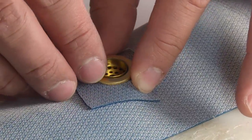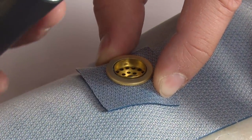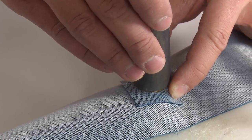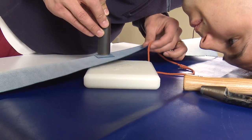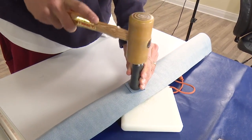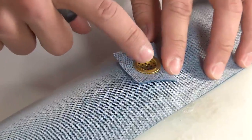It is crucial that the grommet sits on the anvil below and that the top die fits perfectly over the male portion of the vent grommet. After checking that everything is lined up well and seated appropriately, we can use a mallet and give it a few gentle blows to help roll the edge of the male portion around the washer.